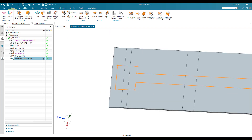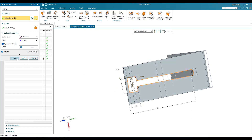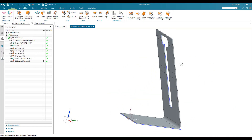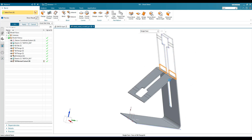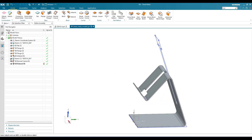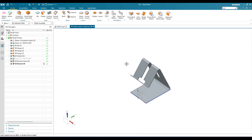Once done, we have to make a normal cutout — the material has been removed, click okay. Now we have to rebend. Go to rebend and select these two edges, click okay. We don't need this sketch visible, so we can switch it off.